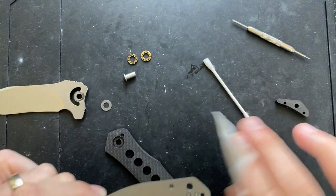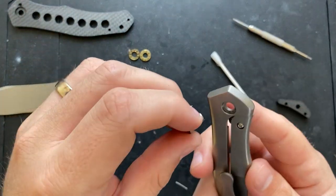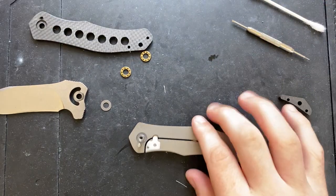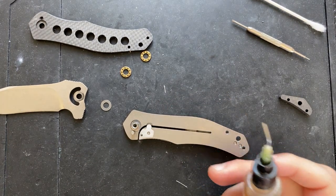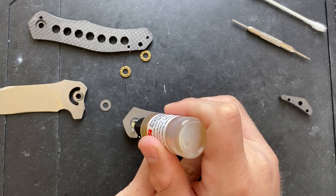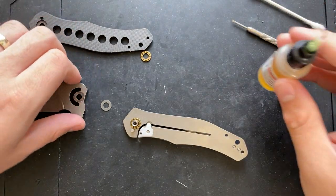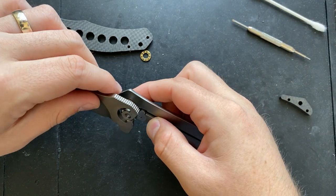I'll clean off the rest of this — is that blasted? Yeah, I guess it is. Let's go ahead and put this guy back into place. So let's start the reassembly process. If nothing else, it's a relatively simple knife. By the way, there is also a full-tie version of this knife, which looks exactly like this, but I'm not going to bother doing the assembly there because it doesn't make sense to do that twice. Might as well keep one of them virgin for him to resell afterwards. I'm going to put a little bit of 10-weight nano oil on this guy, because that tends to work better with bearing-based actions. I'm going to put a drop of lubrication into the detent ball hole, which will help lubricate the detent ball track overall.